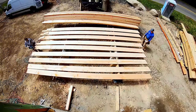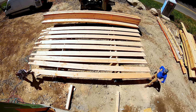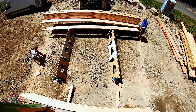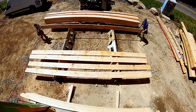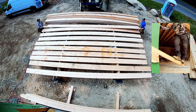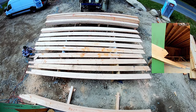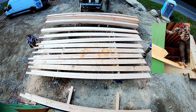Yes, I always overcut my rafters just enough that the scrap comes out. I'm not going to use a handsaw — that is a waste of time in my opinion. As for overcutting: cut a three-foot tail, overcut it so the scrap falls out, take that rafter, screw it to a wall so the tail is about a foot off the ground, go stand on the end, balance and bounce on it — you're not even going to hear that tail crackle. It really is quite amazing. I've done that and posted it on Instagram. It is pretty eye-opening.